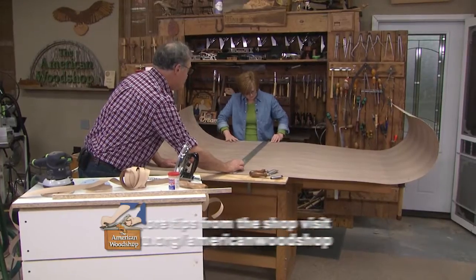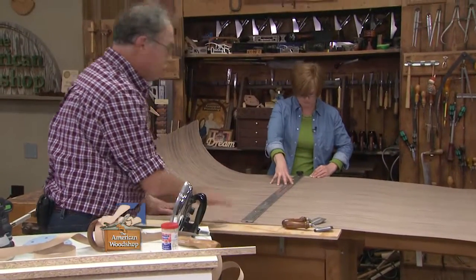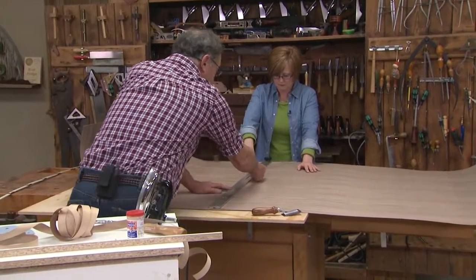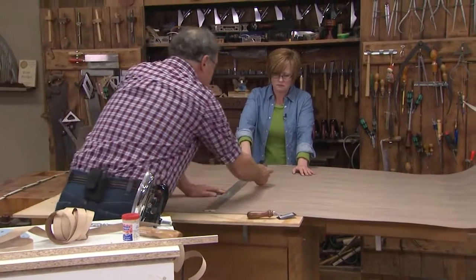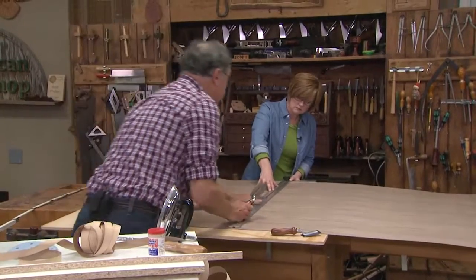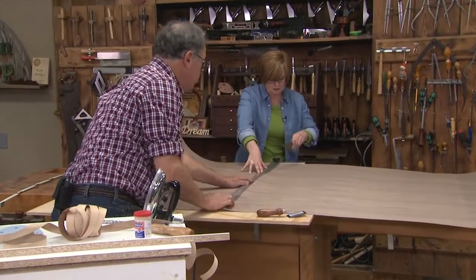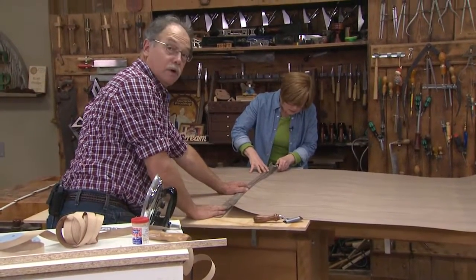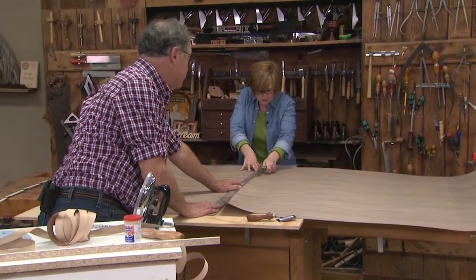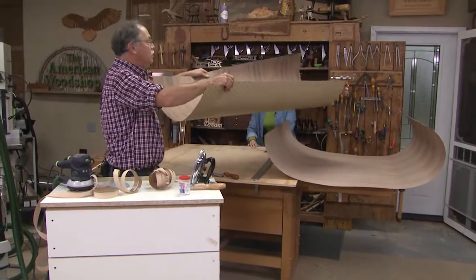I want you to slide it to this edge, right here. On the line. What we're doing with a 4x8 sheet of veneer is using a veneer saw — a handy little tool. I score it here and hold the edge of the saw blade up against the straight edge. Whenever you do veneer work like this, it really helps to have two people. I want you to do the same thing on your side. She's never used it before. Score light cuts — usually you have to do three or four cuts. So that frees it up, and that's all the way through. That's the easy way to cut veneer.